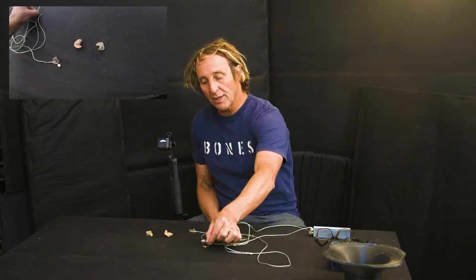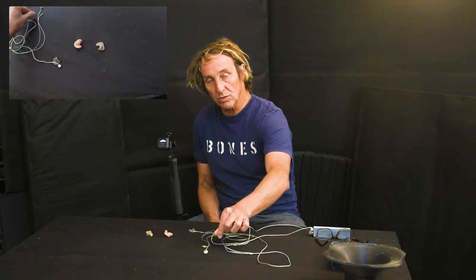They both have their advantages and disadvantages. The speaker type driver's got a larger diaphragm. It's more conventional, more like what we're used to hearing with a speaker. It's just a diaphragm attached to a coil, and the coil moves, and when it moves towards its limits, it hits mechanical resistance, and it's a sound that we're very accustomed to because it's how most speakers are built. The armatures, on the other hand, have a metal plate between two magnets and some coils attached to a little pin, and the pin is attached to a diaphragm, and the diaphragm is inside an enclosure. It moves the diaphragm back and forth with a considerable amount of force, and that creates sound pressure, positive and negative pressure, that comes out a small opening or a little hole in it.